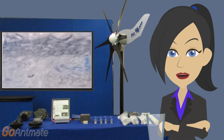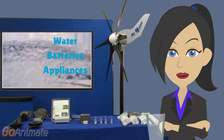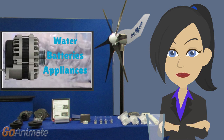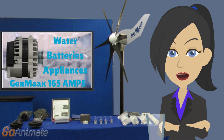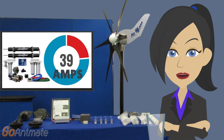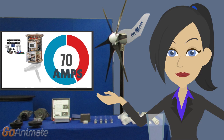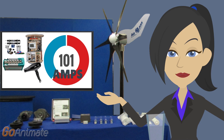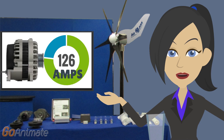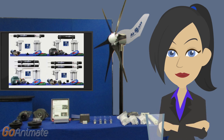What would you say if I told you you can have all the water, charge your batteries and run your appliances at the same time when either underway or on the hook? With the Genmax super high output alternator, you can do all that in about an hour a day. 39 amps for the watermaker, plus 30 amps for other appliances — that leaves plenty for the hairdryer and the batteries when your Genmax 215 is putting out 165 amps continuously at high idle. You choose 12, 20 or 30 gallons an hour of clean fresh water for your family and your boat, and your batteries are charged at the same time.